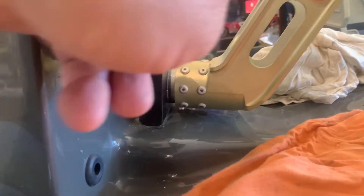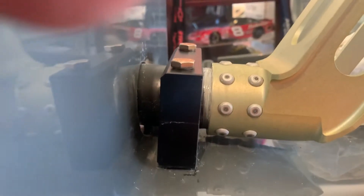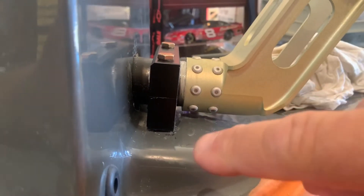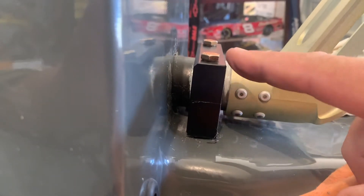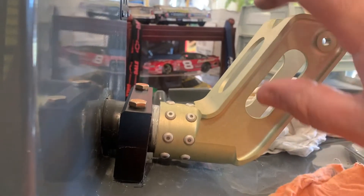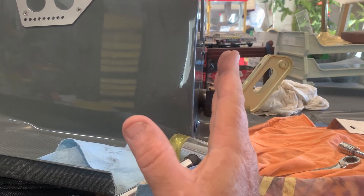The problem is we're drilling a hole down through the seat, and the bottom of these blocks don't sit flat on the base. When loose, the torque tube is going to go to where it's naturally fitting, which is more forward. So if you come to 0.093 off of here and drill down, what happens is you set the block down and drill through there. As you tighten the bolts underneath, it brings these blocks up until the bottom is flush and level with the seat base. When it does that, it binds on the torque tube — it binds because the blocks are at an angle. When they're at more of this natural angle, they work good, but when you tighten them down, they have to match the angle of the seat base.